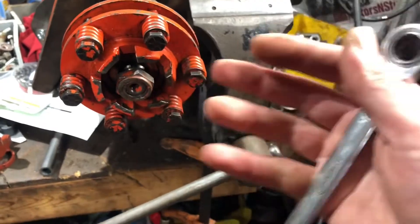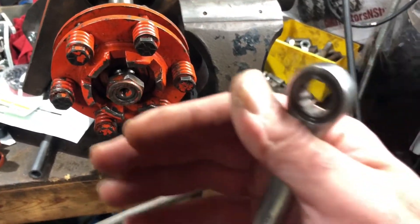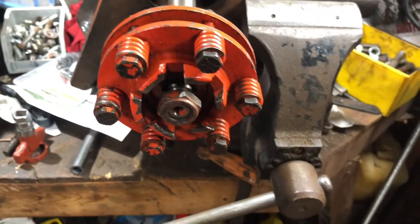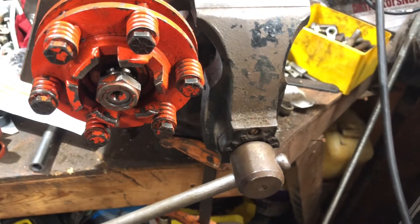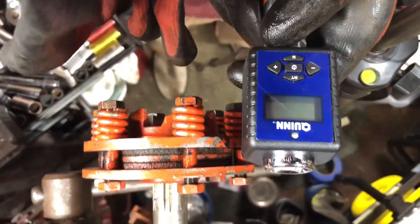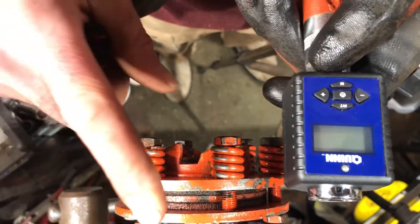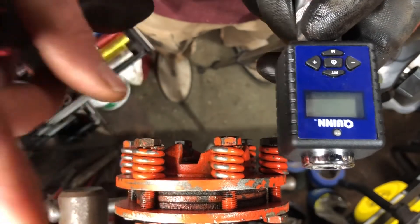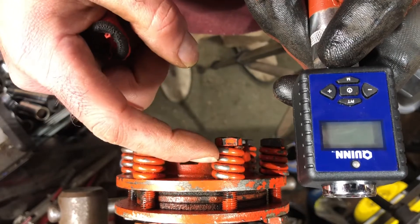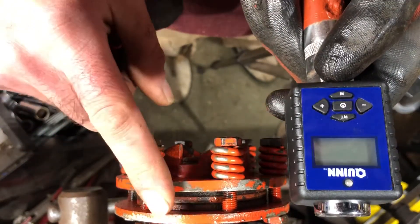Things may change over time. You have the initial break - the friction of breaking force - it's kind of like ABS. That's why ABS brakes work really well. You have that force to break free versus the continuous slide - those are different. But this might change over time after you do it a few times; it may go up or may go down. So let me set the camera up and let's see what we get. You could still have some variation because of all those factors; it's just a rough set point. If you don't have a torque meter like this, you set these PTO clutches by screwing the bolts all the way in until they're fully seated and the spring is fully compressed, and then you back them off a half turn. That's a good rule of thumb, but actually I want to see what it actually reads - that's why I got this.